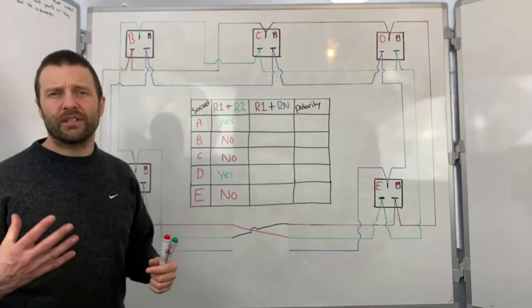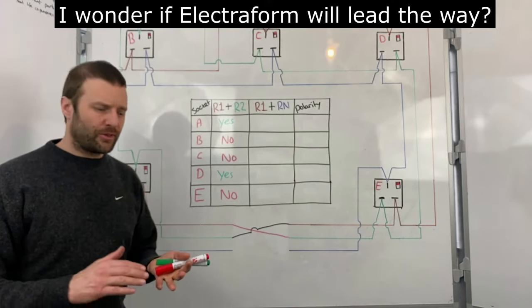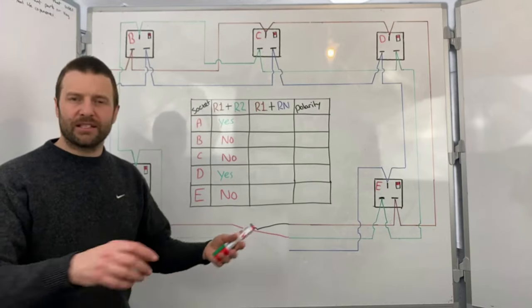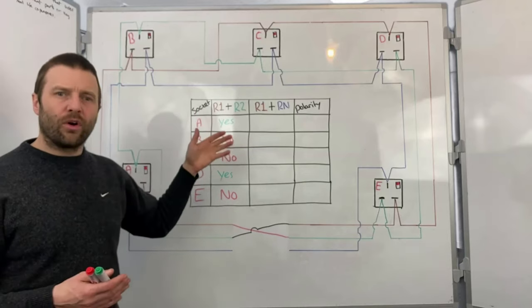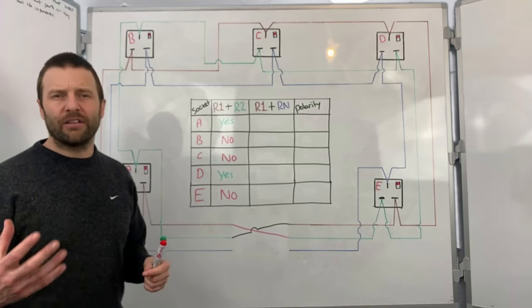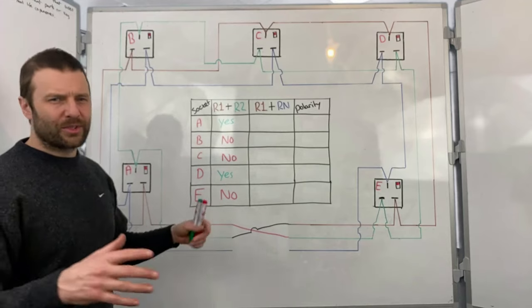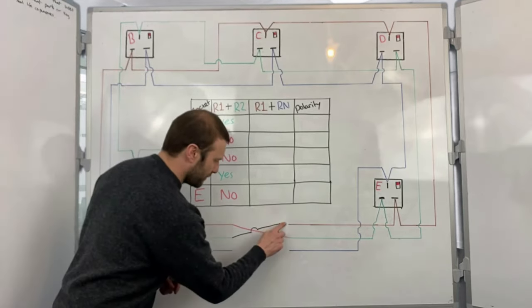And I wish the IET would do something about the model form that, you know, it's in Guidance Note 3, it's in the On-Site Guide, it's in every testing manual that we've ever read, and yet it's not on the model form. So I don't know why, it seems ridiculous. And I think I've heard the E5 guys call it one of the hidden tests. Okay, or unknown tests or something like that, one of the hidden tests. So let's connect that up into a figure of eight then.